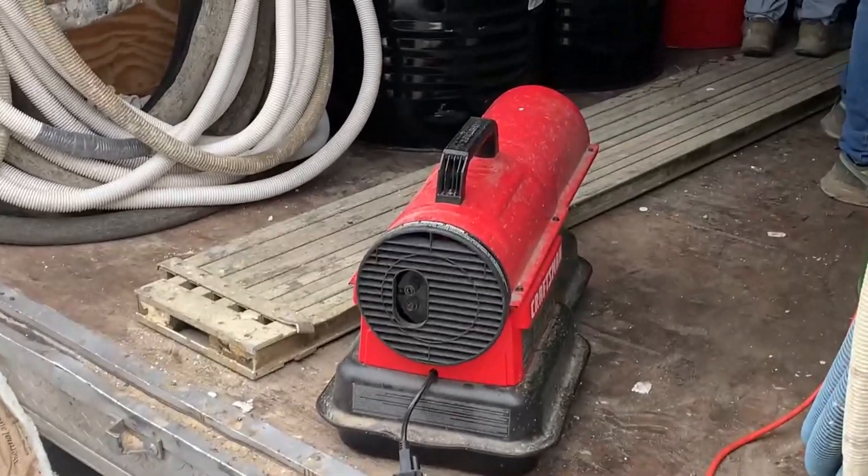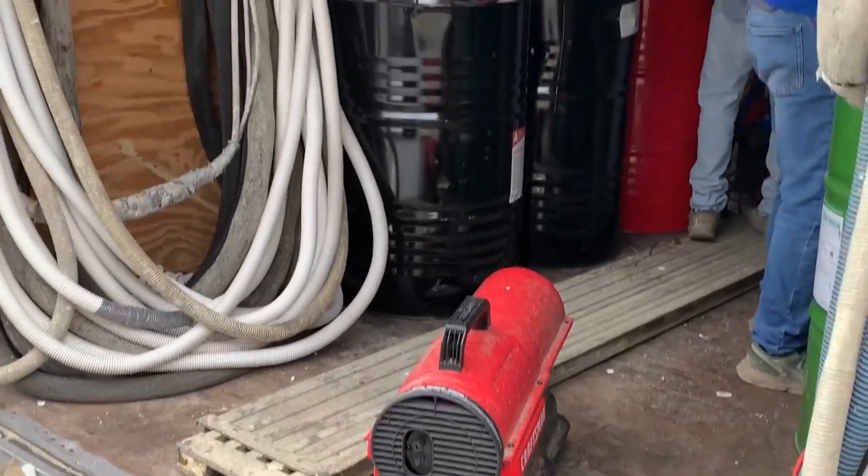Here's an interesting thing. Right now, despite my short sleeves, it is 48 degrees. 48 degrees out here means it's actually a little bit too cold to apply the chemicals for this closed cell insulation. So what they've got to do is warm the temperature of their mix up so that it'll be warm enough to actually work properly. The best temperature for that is 110 degrees, so they have a little heater in their trailer that's going to heat everything up and keep it warm so it comes on good and sticks and does its job.